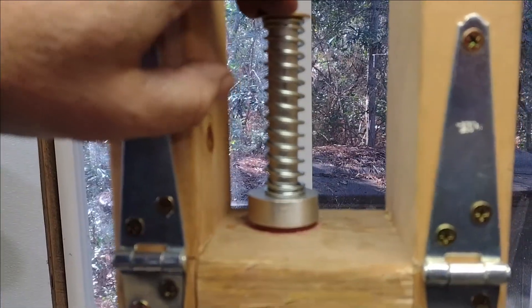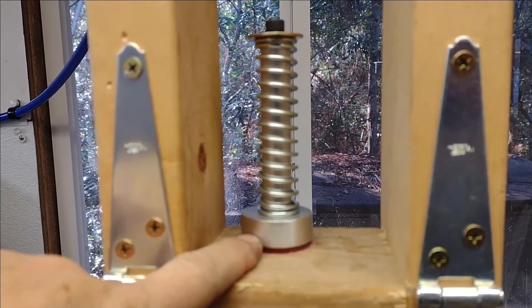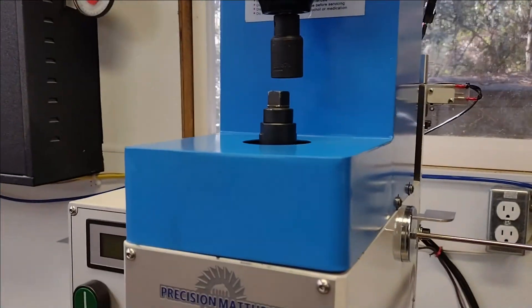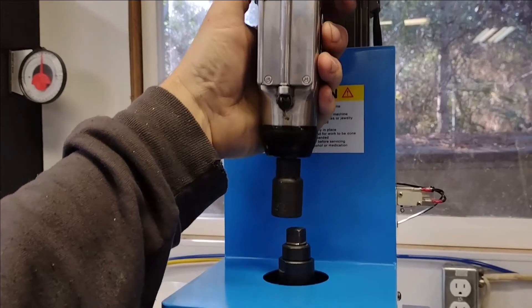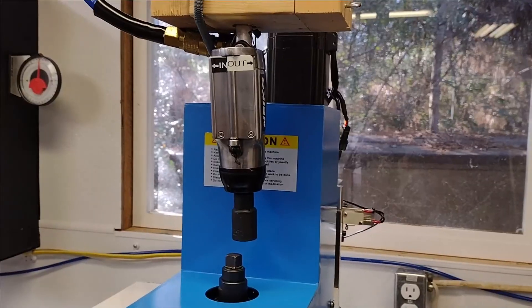So I did a little more investigation and found that the spring compression really wasn't that great — not like I initially measured. So I made up a half-inch spacer out of some spare round 6061 stock. There's now a lot more spring tension, so this thing requires a little more pressure to get it seated, but then it's firing right up. That problem is resolved. Thanks for watching — cheers!